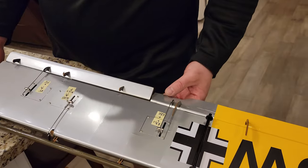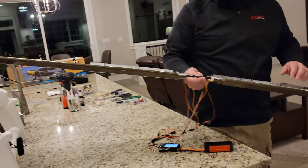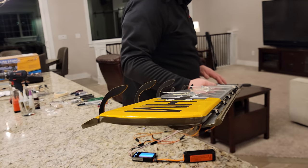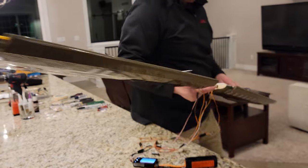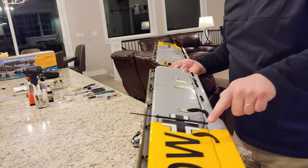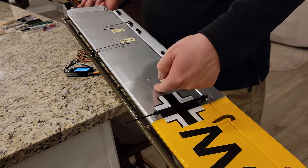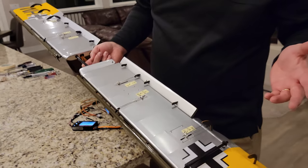I don't think so, because we have about the same amount of deflection on the ailerons as noted by this bite point here. And that bite point, watch when it comes around. See, it's not quite biting, but it is biting. That can be adjusted with this screw, okay? Just loosen this screw, slide it back slightly. And that's something we're gonna mess with once we have the separate independent controls. I just wanted to show you it working.